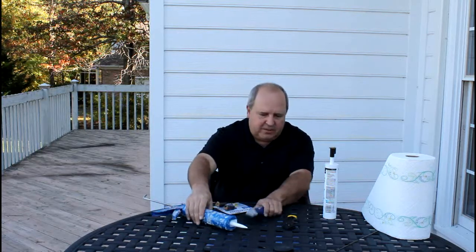The other items: I've got a utility knife for cutting the tube open. We've also got this little rubber tool with a point on it. Traditionally you do caulking by hand, running your finger down there — it does get all over your hand. This is a rubber-tipped piece with a nice straight flexible rubber tip. You put it into the corner of the window, run it down, and it gives you that nice line you're looking for on the caulking without getting it all over your hands. Then you can wipe it up with a paper towel.